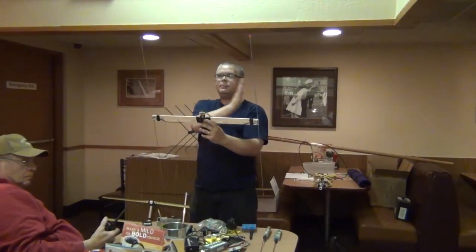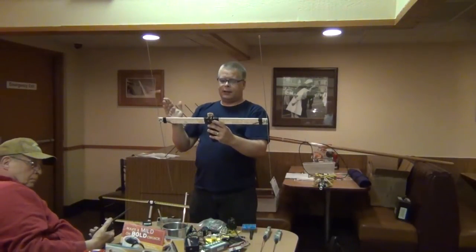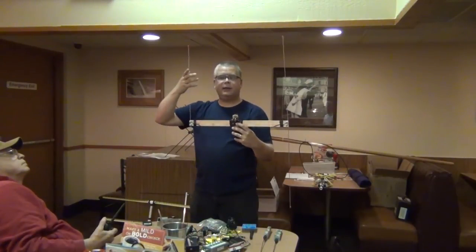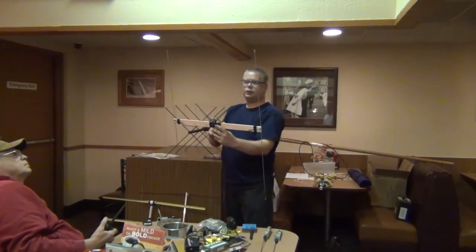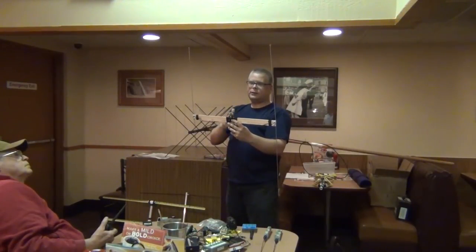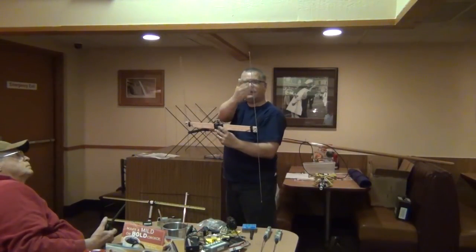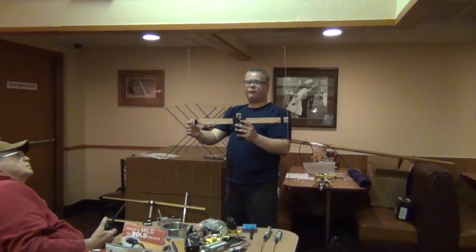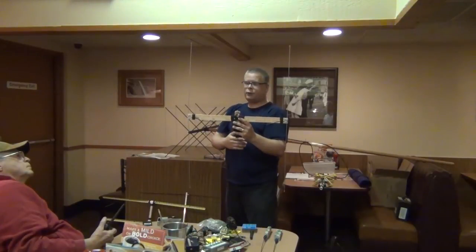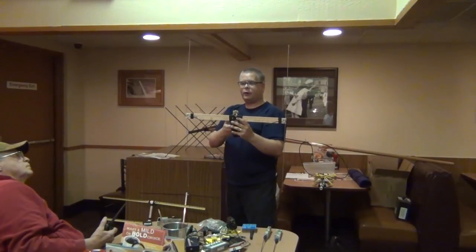The principle is by switching between these two antennas, it looks at the phase of the RF wave coming into the signal. If they happen to be equidistant from the transmitter, you're not going to get any change in listening from this location to this location. However, if they've got a different location from the transmitter, as you switch back and forth, it's going to impart that 500 hertz tone onto the FM signal, and you're going to actually pick it up on the FM receiver.